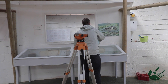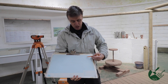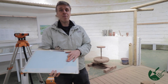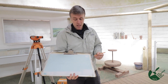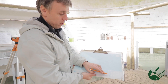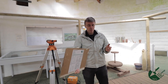It's a slow and laborious way of getting levels, but my favourite thing about it is that all these levels are written down on physical sheets of paper like this. You'll see these in lots of our other videos. All the levels are listed on one side and the reduced values on the other. Paper lasts a long time — hundreds of years — and we are not contingent on some version of AutoCAD, total station software, or GPS software being updated. For field school, we also give students prompts on the sheets: what's your temporary benchmark, what's your backsight, and so on.